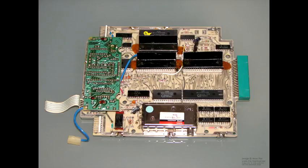Here's a photograph of one of the earliest circuit boards, very typical of a late-70s design. Mattel introduced this product around 1981, so it was designed in the late 1970s. Highlighting the most significant chips: first, the graphics chip, a 40-pin DIP; next to that, the graphics ROM — two kilobytes, that's not a typo. There's also a sound chip, a 352-by-16-bit RAM, which is not even a kilobyte. Tiny compared to today's gigabyte systems, but clever design produced really enjoyable games on very modest hardware.